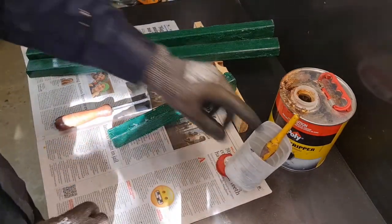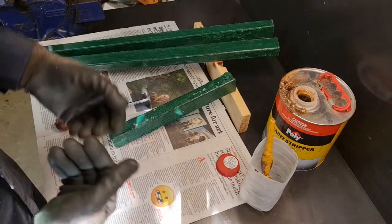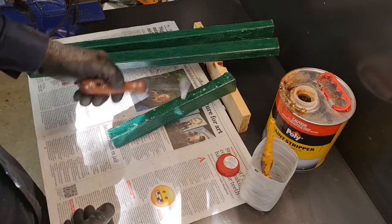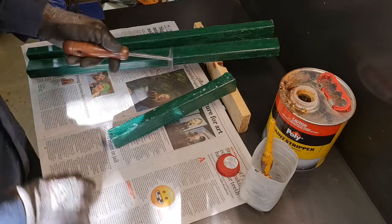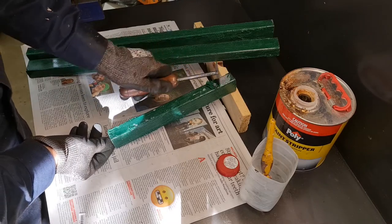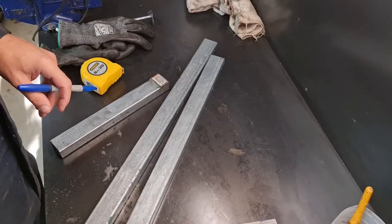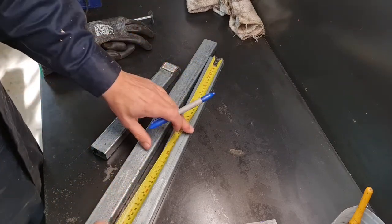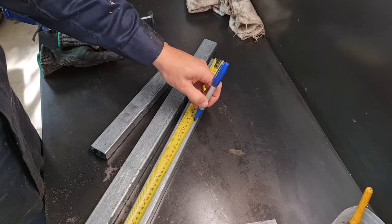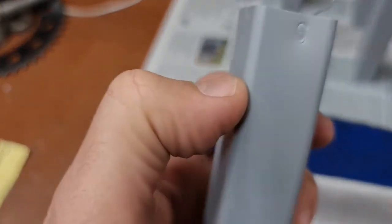What I'm doing here is some test painting to see what the black is like, so we can pick the closest black finish for the frame. I've got this scrap metal with a bit of paint stripper on it — it's been on about five minutes. I'll strip the paint off, cut these into lengths, and here I've painted the test samples with an etch primer followed by a primer filler — a thicker priming coat. They're all ready for the top coat.